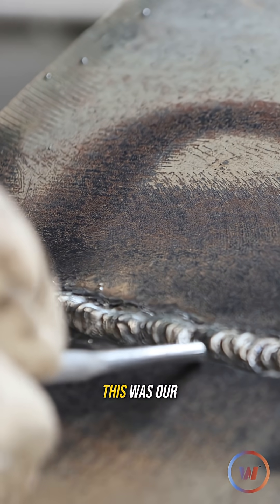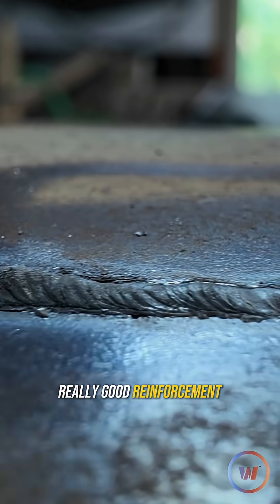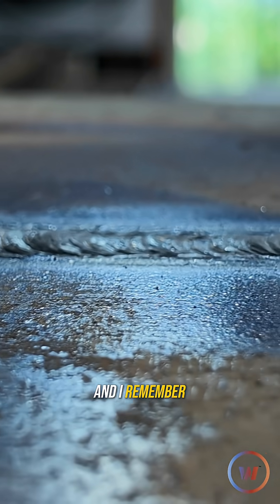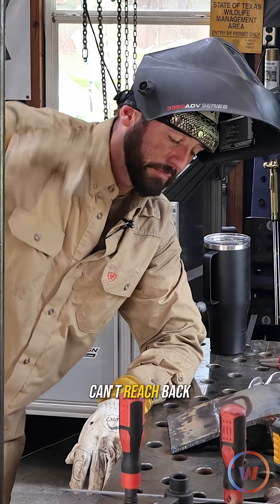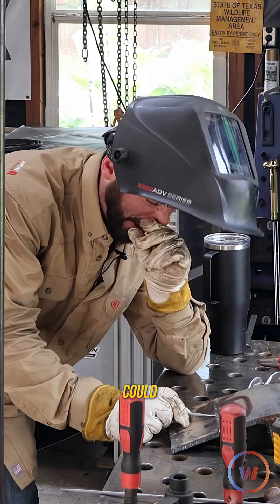This is the flat portion up to this point. This was our tie-in. After I tied in with the overhead, we had some really good reinforcement, then it started to flatten out. Toward the end I got a little higher again, and I remember I got a little uncomfortable and wasn't able to really reach back there and throw that metal back on itself like I thought I could.